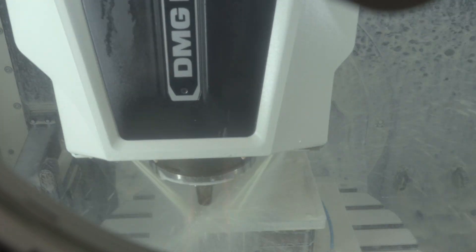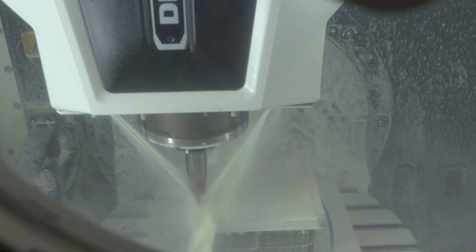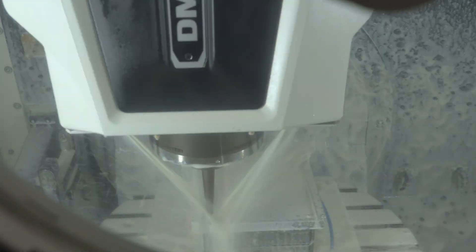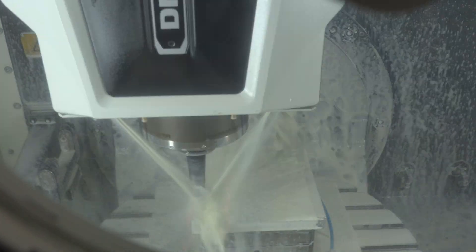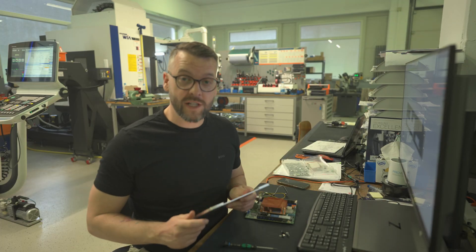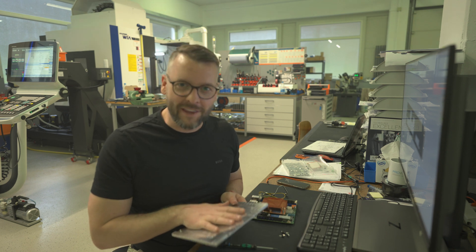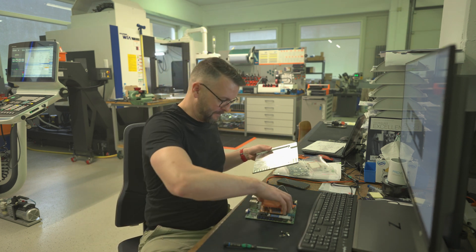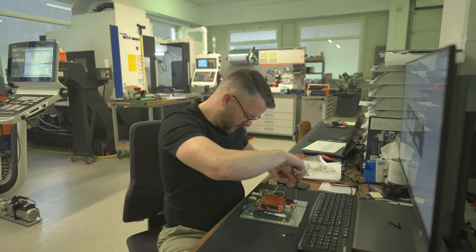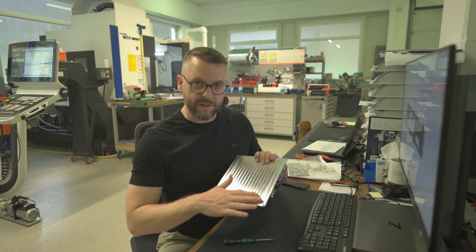In this section we're milling the top side of the base plate on which the mini ITX motherboard will be mounted. The bottom part was already milled on another 3-axis CNC machine, but we could not record it because that machine does not have a window to record through. The base plate is now complete, so we're going to test our mini ITX motherboard and see whether I screwed anything up when designing this base plate. Everything seems to fit perfectly, so I'd call this a success. This is not a final piece yet because it still needs to be anodized and the feet are missing.